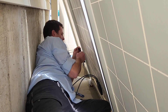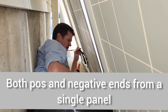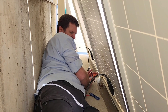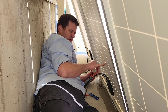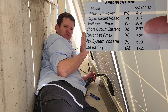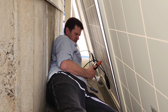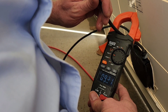For the short circuit current, you just plug them together and measure the amps. First panel reads 10.33 amps — actually performing above the rated spec on the back of the panel, possibly due to snow reflecting additional sunlight. That's better than stated. This one is right at 10 amps, and this one reads 9.75 amps.